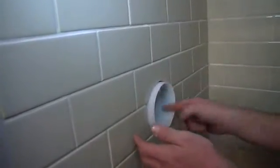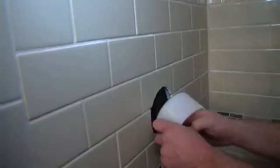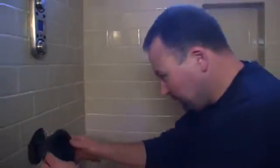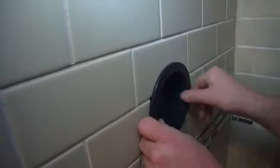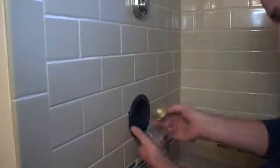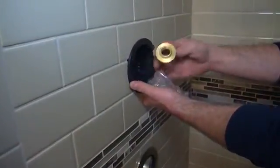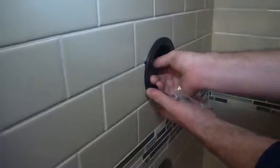All you have to do is unscrew the rough end plate. Install the new housing, which is actually labeled where they would like it at top. And what Moen's done here is once again real smart. The nut actually will center the housing on the body spray valve, and will actually center your housing as well.